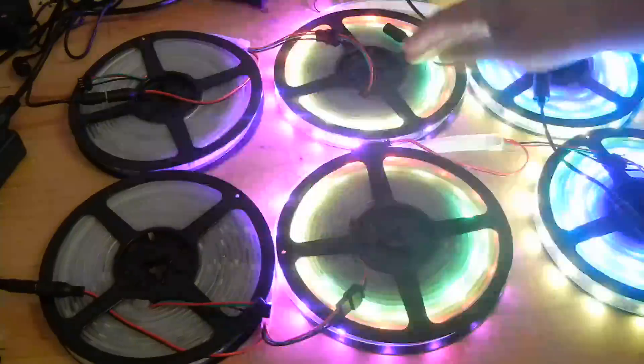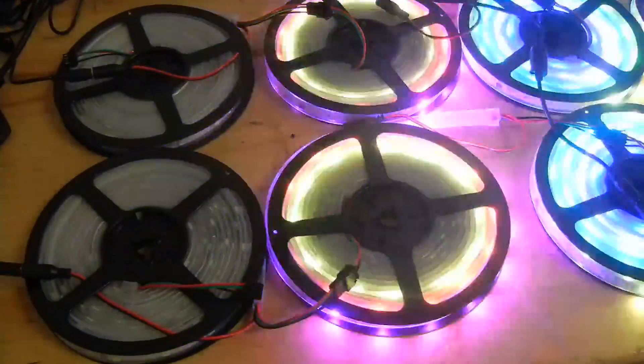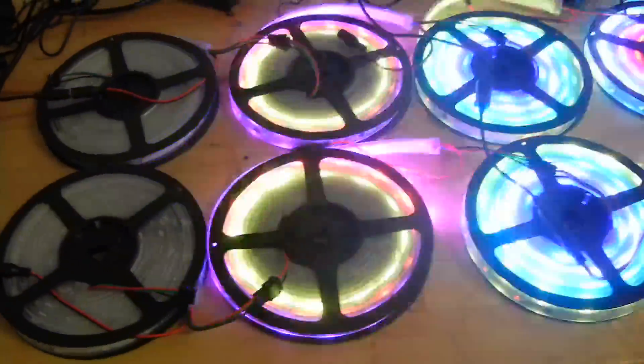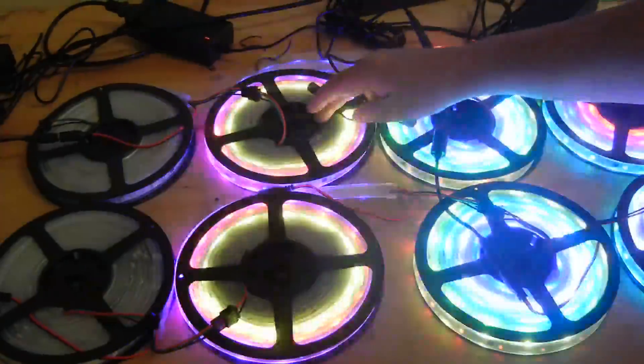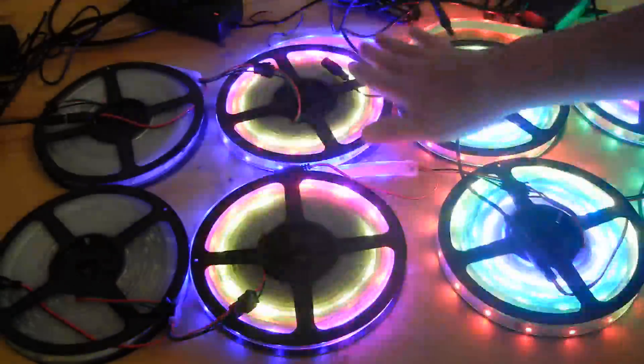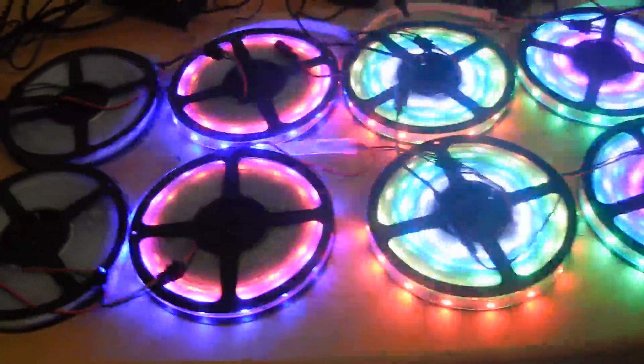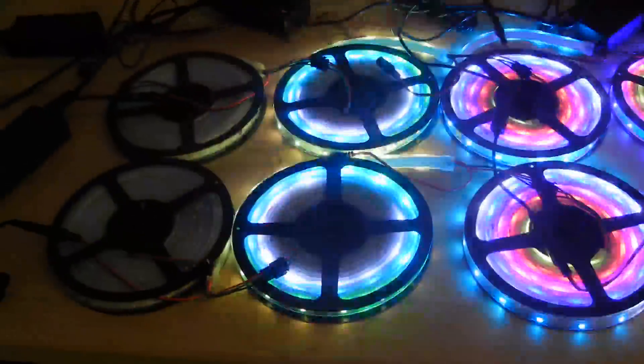But I don't see why you'd want to cut them, since you have a controller telling you exactly what lights to turn on. If you have overlap, to me it's easier just to leave the overlap, because usually these are up in crown molding — they're hidden, creating a light effect. You don't void your warranty by not cutting them. Just tell the controller how many to turn on and let the rest overlap, because nobody's going to see it anyway.